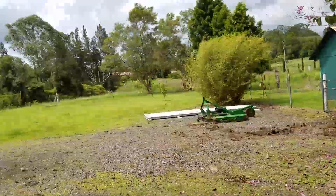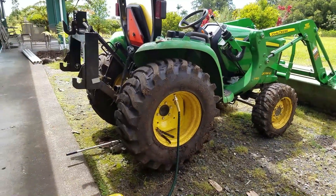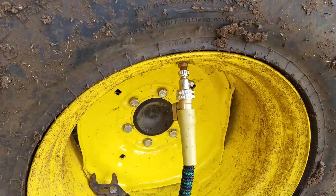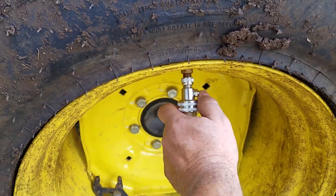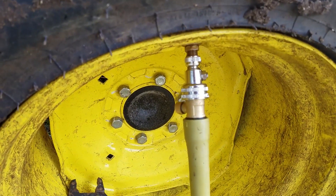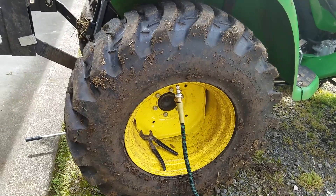So this weight should act as a ballast box. They say each tire can handle about 60 gallons, so that's a lot of weight — that'll hopefully keep me lower to the ground. As you're filling it, stop the water once in a while and let the pressure out. If only water comes out and no air, that means you're full of water. So I'm full of water right now — otherwise the air would come out. Now I'm full and I'm ready to stem back in.